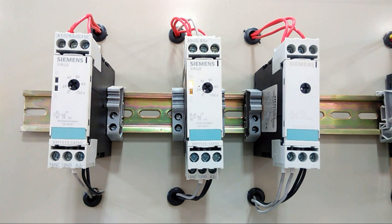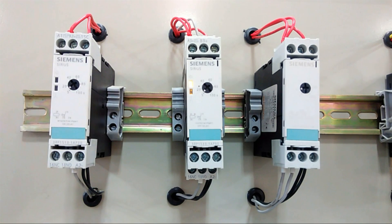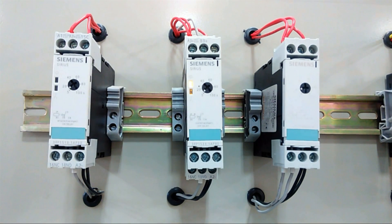You can get indication from this LED. The second instrument is the off-delay timer. Similar to the on-delay, you can set the off-delay from this instrument, and here you can change the timer value. On the downside you can connect the NO and NC terminals and get the output.